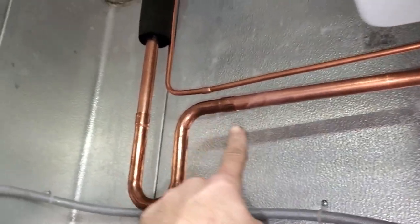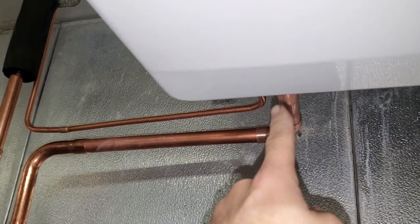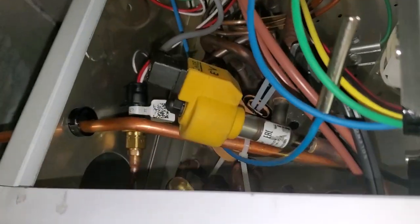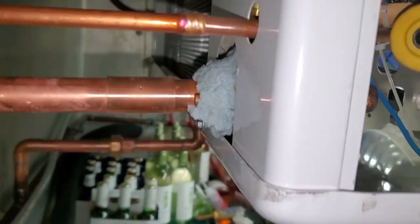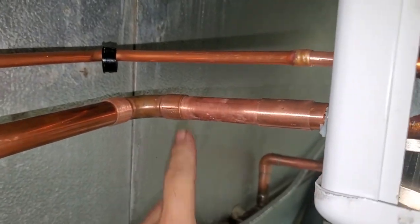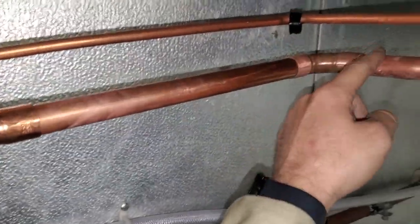We're going to do these braze joints carefully — we'll do these welds first, slide on the insulation, hold it back with the tubing cutter, and then do these ones right here and let it slide on. This one doesn't need a spot for the expansion valve because it's an electronic valve. I grabbed some Viper wet rag and wrapped it all around that, moving the black bushing out of the way so it's not going to melt. We're going to do this braze joint and this braze joint first, then we'll slide the insulation and come back and do the other ones.